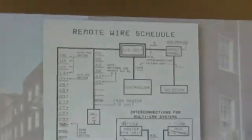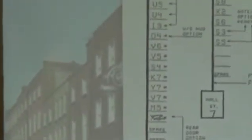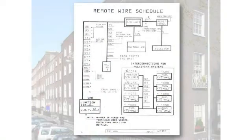Well, in this case, we had 5 to the junction box and 12 to the COP. Again, we're giving you all the terminals heading down there. We also added a couple of spares in, if you'll notice. So this is a really good indicator that you're going to have 12 to the COP and 5 to the junction box. Now, when we say junction box, we're talking about the car top junction box. So we kind of lay all this out for you.